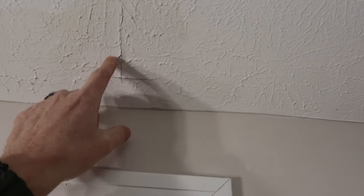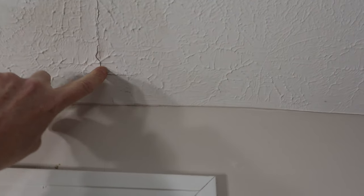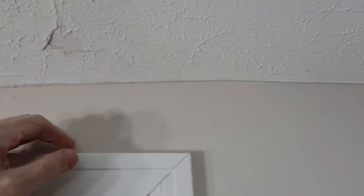The skylight's up there, so it leaked below — pretty obvious it was the skylight. That's been fixed. But you can see there's some discoloration in this area. There's some cracking and peeling along there. There's a drywall tape joint going straight up the wall. It's going to be about 18 to 24 inches wide. I can get my full mud blade in there and get a nice smooth transition across, so the whole area will need to be painted — but we're just going to get this thing repaired.